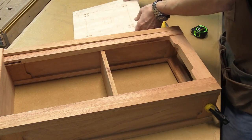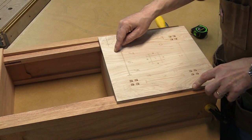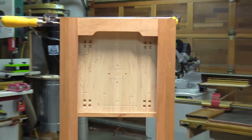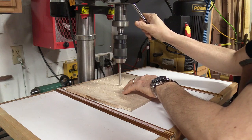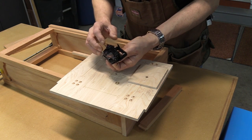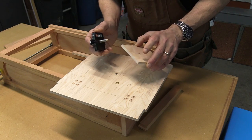I've got the door piece in there. My goal is to have the clock face centered in this opening, so I need to take an inch and a half off the bottom — that'll give me a half inch reveal all the way around all four corners. The clock face is in and the reveal is just about dead-on perfect. Here's the clock movement — it's an inexpensive quartz one with an arm for the pendulum. I really didn't want a mechanical movement; I had a mechanical clock in my office before and I absolutely hated it — the clicking noise drove me insane.